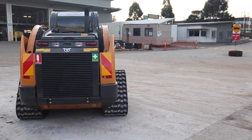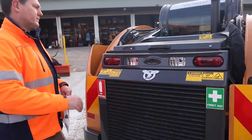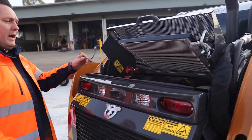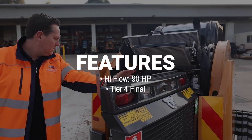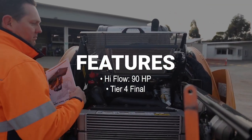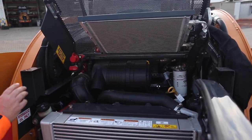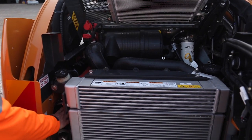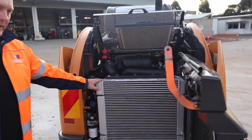On the front of the machine, headlights and side working lights are standard. There's also a heavy duty rear door — you don't have to worry about hitting it and having to replace it. Getting into the back bonnet, it's a Fiat powertrain, 90 horsepower, tier 4 final. Nice and tight — easy e-stop, dipstick, diesel fuel fill, hydraulic filler, and AdBlue tank as well.